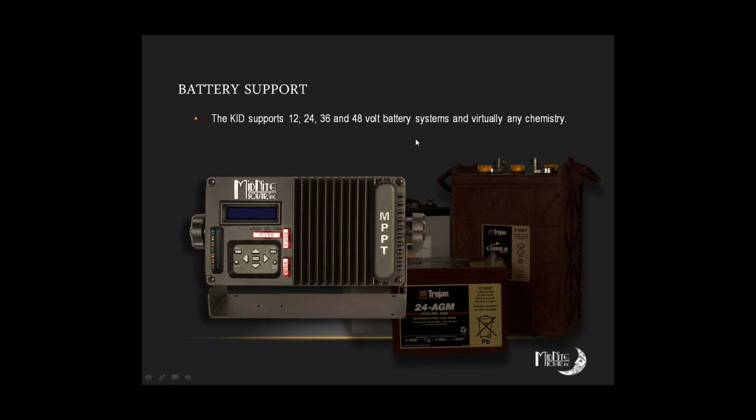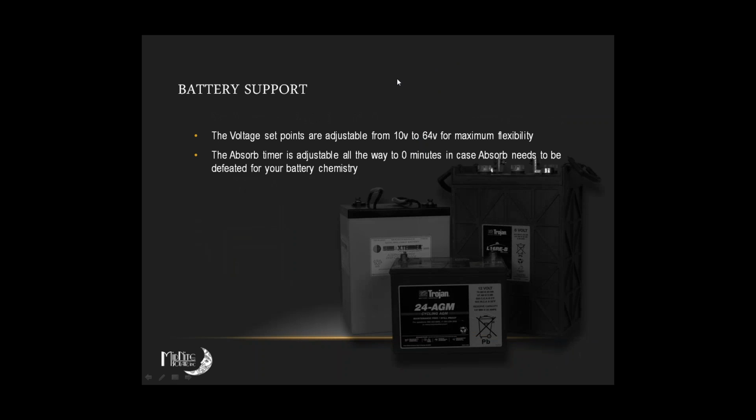All right, I think you guys are past this already. You've already decided on the AGMs. Good choice. Any idea what you're using for an absorb time on those full rivers? We haven't gotten into that yet. Okay. Yeah, it's always best to check with the battery manufacturer to see what they recommend. I usually use a default of 2 hours. That would be the minimum. But the battery manufacturer should be your go-to for any charging voltages and absorb time.